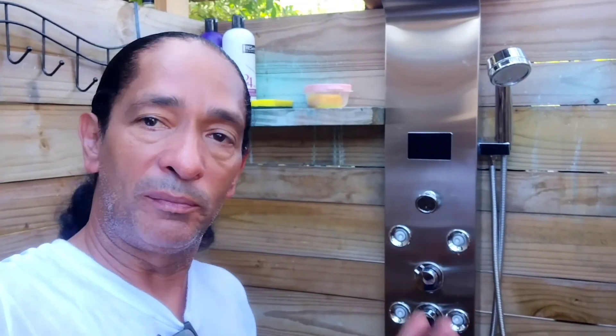So there you go — I've installed the outside shower. Hope you guys learned something from this. If you use this shower inside your house, remember you have to do some extra work behind the wall. But the beauty thing is you don't have to do much plumbing — you just bring in a hot water line and cold water line. You don't have to run a pipe behind the wall. You just hang this unit up and connect it into two connections. I really recommend it for the house. I bought it for the backyard to see how it works out, and eventually I will remodel my interior bathroom and use it there also. But right now I want to see if it withstands the use. If everybody's happy with it, I'm going to connect the hot water next to it and I'll show you that unit I got from Wayfair and how that connection was done. But in the meantime, hope you enjoyed the video. Hope you learned something. Everything is beautiful — it's a great day here in Florida. Subscribe to the video. This is Ray Anthony — goodbye, everybody.